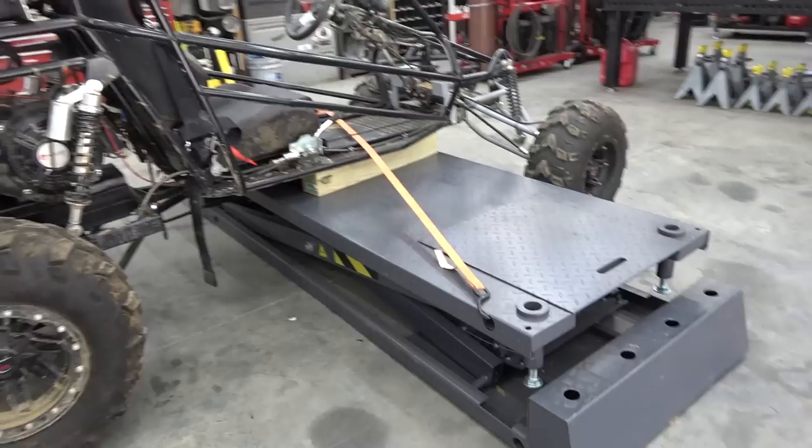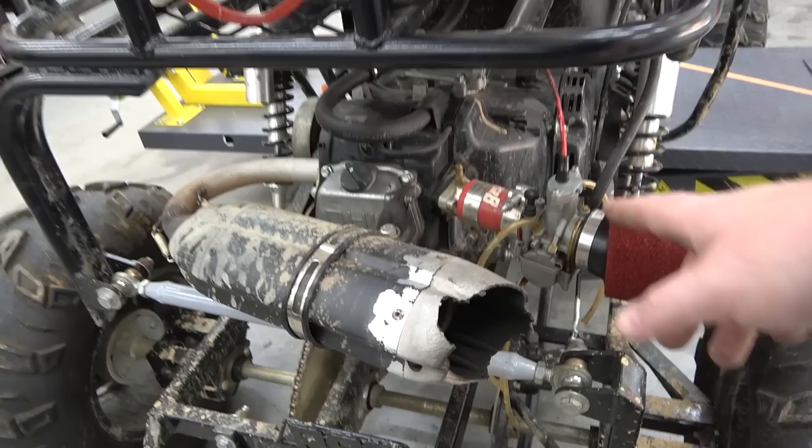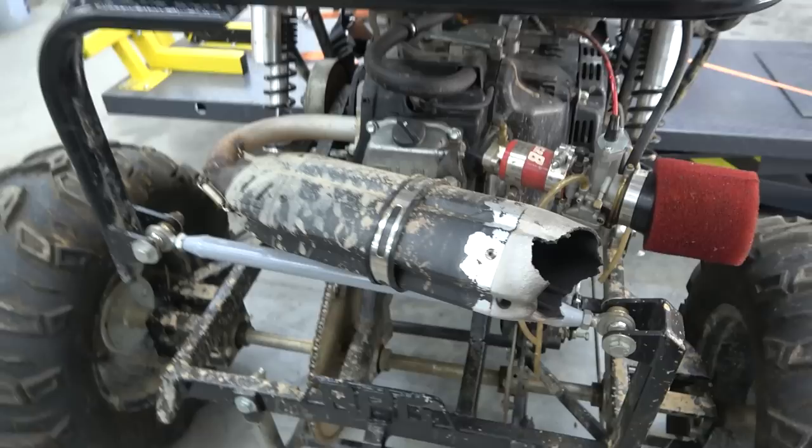All right, so this is the operation we got going on. We got it sideways on the bend pack lift, and these bend pack lifts are sick because you can take the extensions off of them. He was so rich because we never had full time to tune that carb. It melted the aluminum on his muffler. I know you would think that would be lean making the exhaust hot, but he said he ran through 4 gallons of fuel in one ride, which is insane.